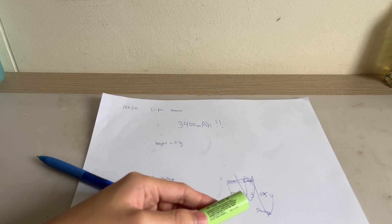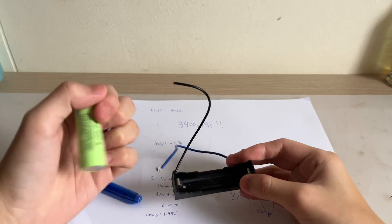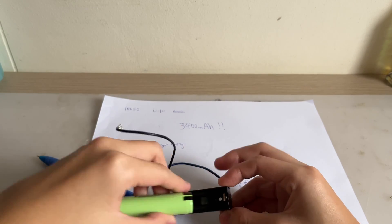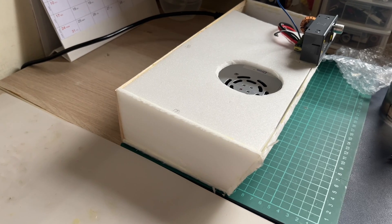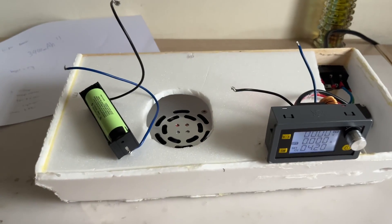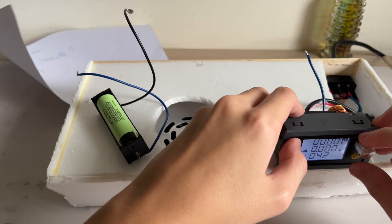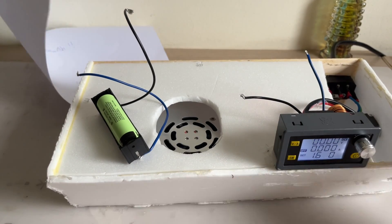So how do we charge it? I have my homemade battery pack with thick wires for current measurement and charging. It's basically just connecting the positive to the blue wire and the negative to the black wire. I'll use my buck converter with current measuring mode. Charging: CCCV standard — 1.625 amps, 4.2 volts, 4 hours. The cutoff voltage is set to 4.2 volts; I'll lower the current to about 1.63 amps for safety while keeping slightly faster charging.